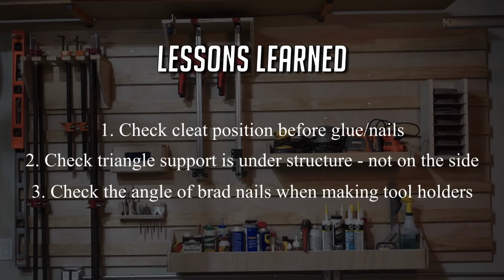Number three is check the angle of your brad nails when you are nailing. As I was putting these together on my workbench, there was one or two that accidentally went down into the workbench. Luckily, I didn't do the entire perimeter of a tool holder that way. Otherwise, I would have had it permanently attached to my workbench. So keep that in mind. Too much angle, you're going to be nailing to whatever is underneath.